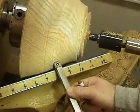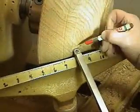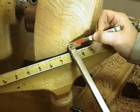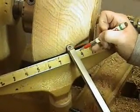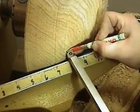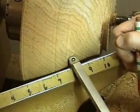The proper angle would be right here. I just want to see about this much of the tip of the tool touching the piece. The left hand edge is making the cut. The tip of the tool — this first eighth to quarter inch is just improving the surface.